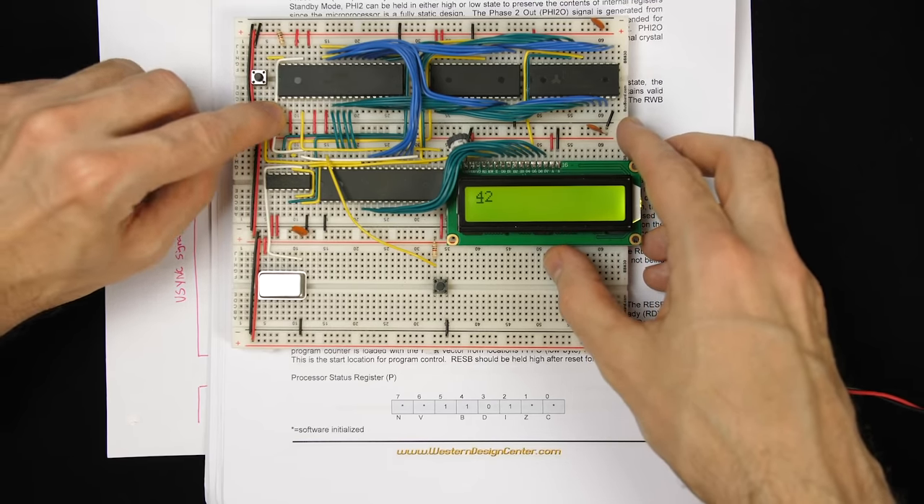The video card can now put an address out on the bus, that address will address something in RAM, and the data coming out of RAM can go back to the video card and be turned into a pixel value that generates the right voltages to go out to the VGA monitor. The missing piece is just the control logic to decide whether it's the video card or the CPU that gets access to the bus at any particular time. During display, the video card is active; during blanking, the CPU takes control. I'll hook up all the control logic in the next video, and the VGA monitor will display what's in the computer's RAM — and I'll write a program or two to display something interesting on the screen.